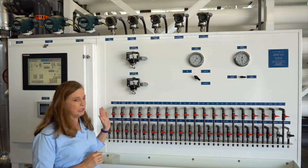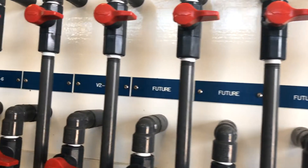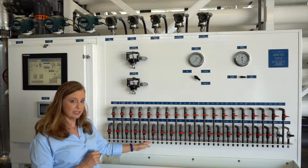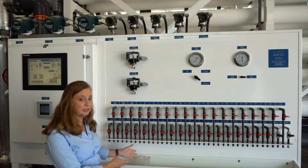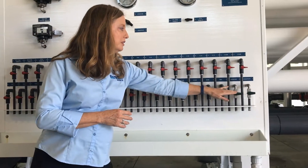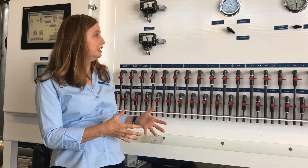The samples themselves are designed to be user-friendly so it's easy to tell what sample is coming from where. They're all labeled with high-quality engraved labels held on by stainless steel screws. The low-pressure samples can be PVC, but instead of flimsy tubing we like to use hard-piped sample connections so it's easy to see where you're getting a sample from. Drain trays are large enough to hold a sample container. The high-pressure taps — interstage and concentrate — need to be stainless, and all the rest can be PVC. The sample tray itself should be plumbed away to a floor drain so that the floor stays dry while you're getting samples.